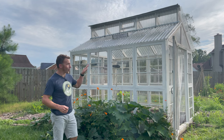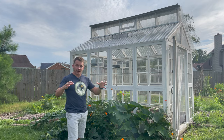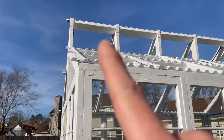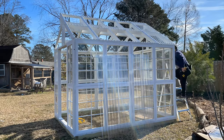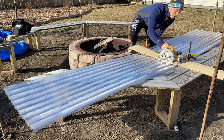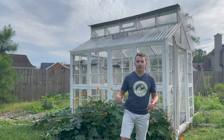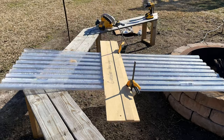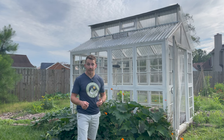After staining was done, it was finally time to put on the roof panels. These polycarbonate panels by SunTuff were super easy to install — you buy ridged plastic pieces which sit on the frame, you install those first, and then you just lay the polycarbonate panels on top and they simply lock together. The only thing to be careful of is cutting each individual panel; depending on the dimensions of your greenhouse, you may have to make more cuts than expected. Make sure you're using the right tools, measuring twice and cutting once. I found that using a circular saw was the easiest way, but take things relatively slow so you're not splitting the panels.